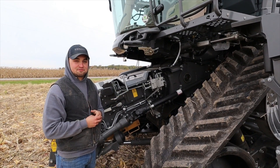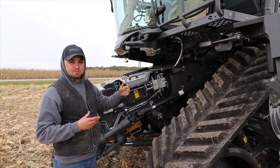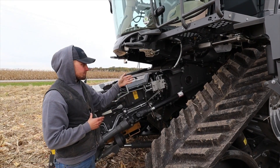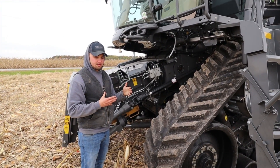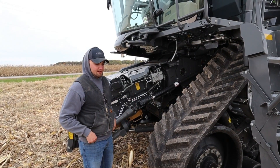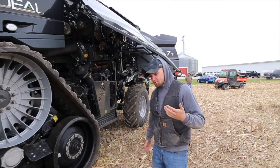Growing up, if we've seen a grease fitting, we'd at least hit it with five or seven shots a day. So it's nice to know how much you're putting in and where you're putting it. There are a few drive shafts on the combine as well. We suggest greasing those at the regular maintenance marks highlighted in the operator's manual. And if you follow me to the rear part of the machine, I'll show you where the grease fittings are for the rotor.